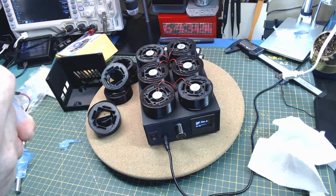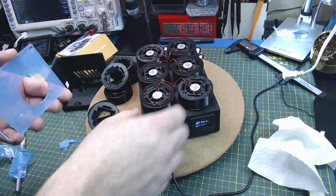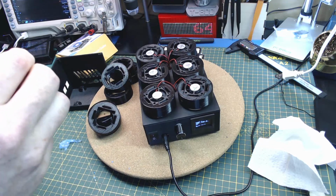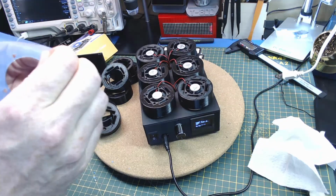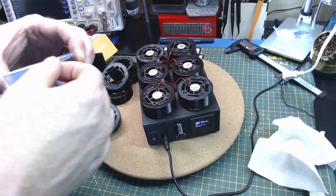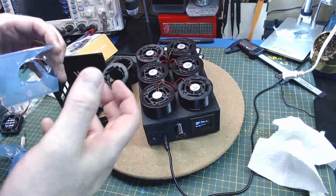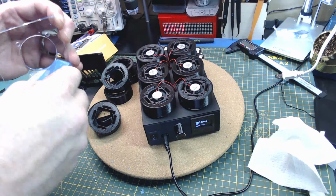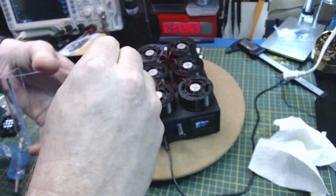I tried a couple other designs early on, and they quite simply didn't get enough airflow, enough CFM correctly over the scent itself to have a good effect. You had to have the fan on forever, and then you only got dribs and drabs of the smell, and that doesn't work at all because you just go nose blind to it, and you have a room mixed with all these smells. This is really pungent. It punches and you smell it, and you get a good hammer of it, and then it's gone and it dissipates. So that took me a while to tune, and that's part software and mostly hardware. And yeah, super pleased with how it turned out.